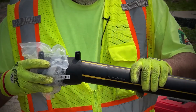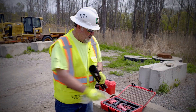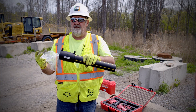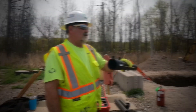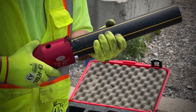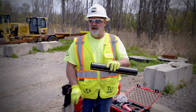Then we can put it in, mark it, peel the other pipe, put that in, and mark it. Then I've got an under clamp to hold everything in line, and then we air test and soap test to make sure there are no leaks. This has been a demonstration of the Reed True Peel to get the oxidation off your pipe to prepare for electrofusion coupling.